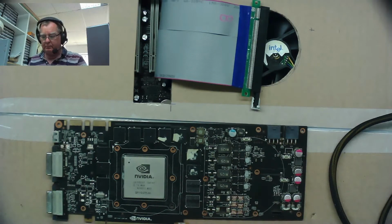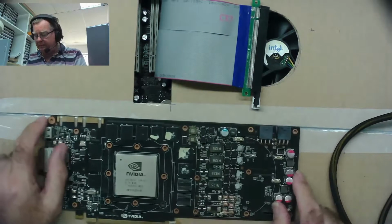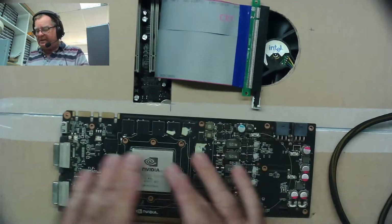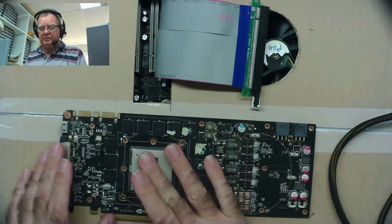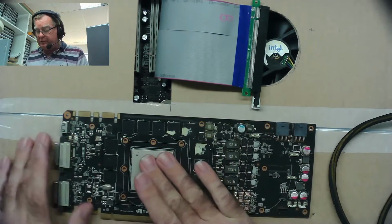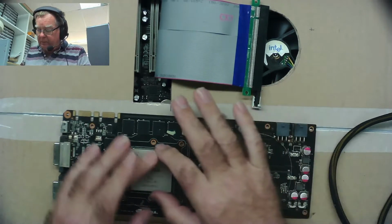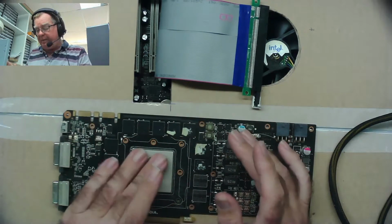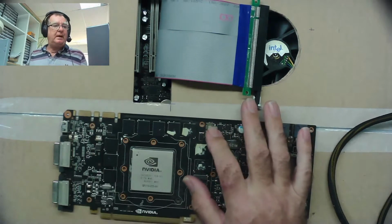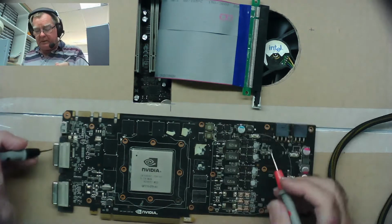Okay, so we've got it unplugged again. When I've taken the heatsink off, this is warm, definitely warm, so it's obviously drawing power. I just don't think it's running as such. I mean, the heatsink and panel there obviously were helping because the heatsink was fairly cool. So, where does this go to, this 10 ohms, which I'm very suspicious of? Where does it actually go to?